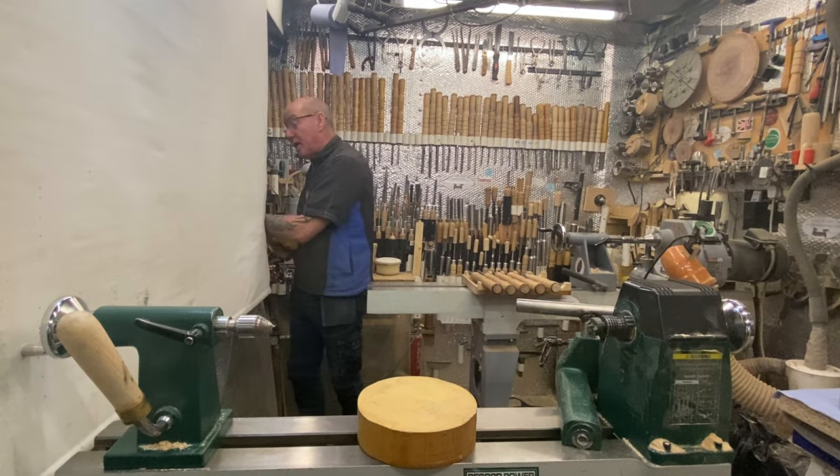To put the dovetail on, just turn the chisel and come in slightly at an angle - just put the point on and come in. That's it - that has put enough of a dovetail on. It's a little slant - tip on and come in nice and gentle. Everything has to be slow and gentle. Now we've got a tenon. We could turn it around and put it straight into the chuck for the tenon option. But we chose to do a mortise, so we're going to take the center out and move things around to the bottom.